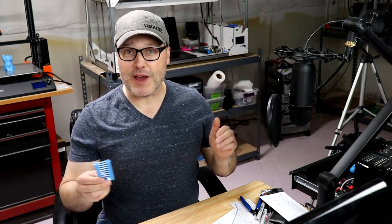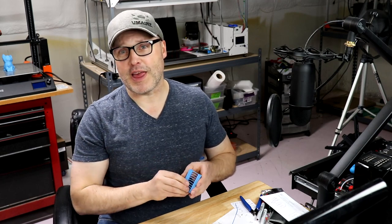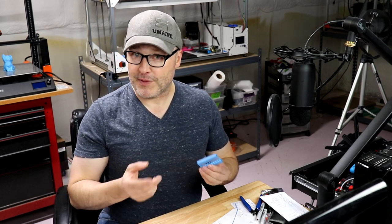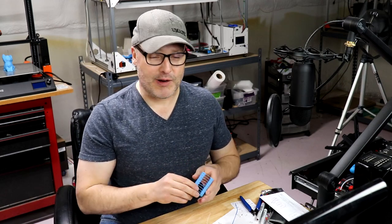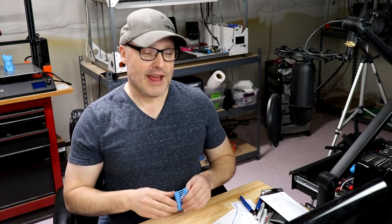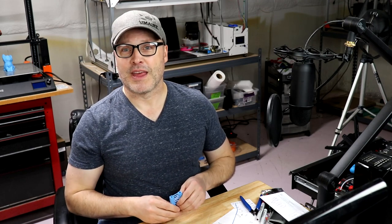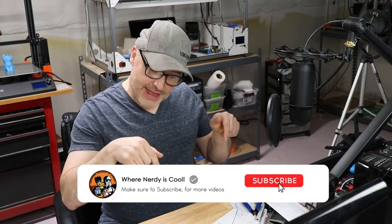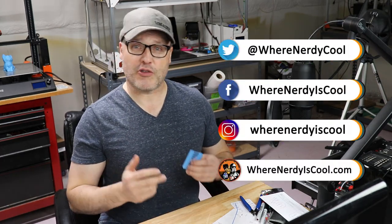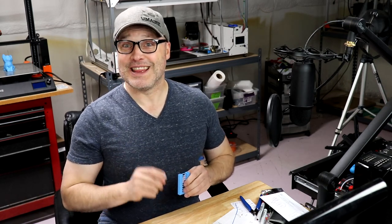Kind of a short video this time — I just wanted to give you guys a quick tip on how to calibrate your materials. When I receive new materials I do the temperature tower first, then once I find the sweet spot I do extrusion multiplier cubes to find where my extrusion rate should be — we'll cover that in another video. There are other temperature tower models on Thingiverse; let me know if you find one that's better or easier. I'll leave the link to this Thingiverse file in the description below. If you have any questions, let me know in the comments. If you're not a subscriber, hit the button below. You can also check me out on Facebook, Instagram, and Twitter to see what I'm working on. Have fun and remember — this is where nerdy is cool.